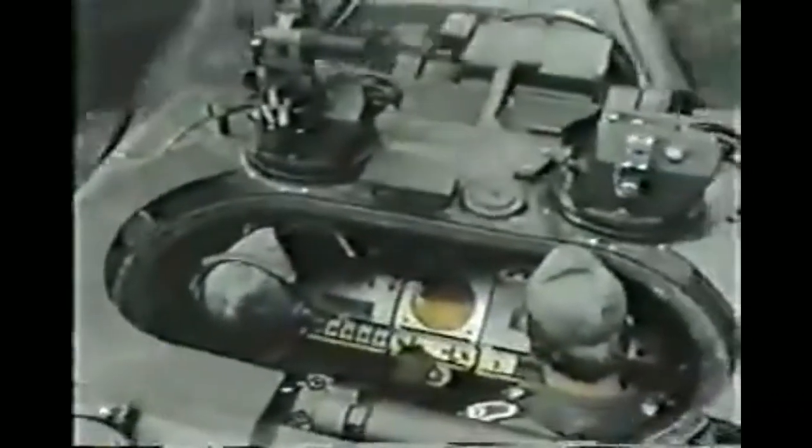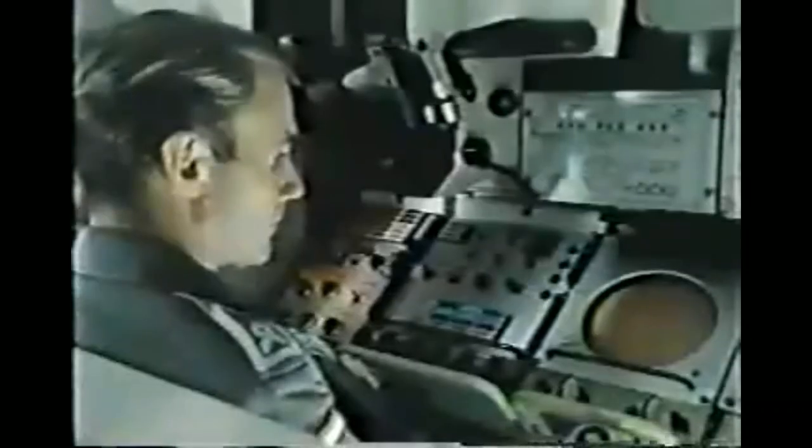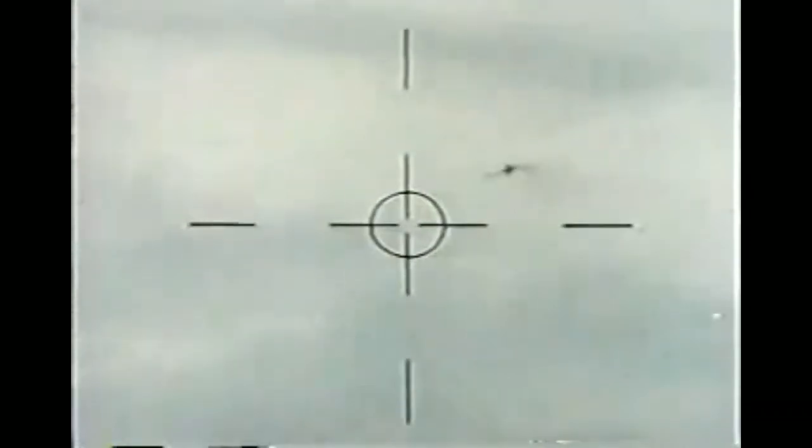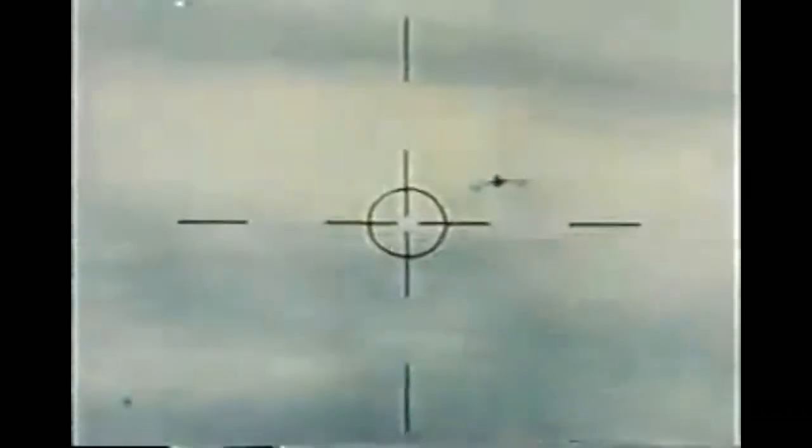The constantly rotating search radar picks out targets at a range of about 10 miles, alerting the crew who cut in the tracking radar on the front of the turret and identify friend or foe. Meanwhile, the search radar carries on completely automatically looking for other potential targets. Once the target is locked on, the onboard computer fires the guns the moment it is in range, normally 3,000 to 4,000 yards. If the computer or tracking radar malfunction, the guns can be fired manually using the search radar or optical sights. Typical of the sophistication in many AFVs, the sights have built-in sun visors, demisters, de-icers, washers and wipers.